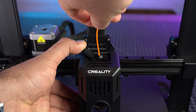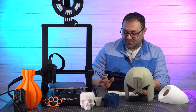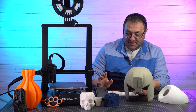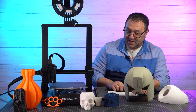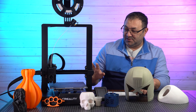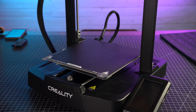If we head up to the extruder, this is a direct drive, which I'm loving. No more Bowden tubes — we get away from that. We can print ABS, TPUs, Ninja Flexes, things like that. And the max nozzle temperature for this is 300°C. Again, you need that kind of temperature for these more exotic filaments, and I have printed some TPU on this. I actually have it on a build right now, and the TPU worked out really, really well.